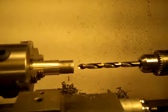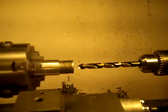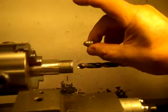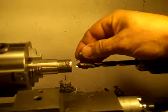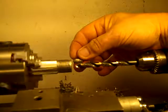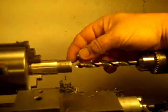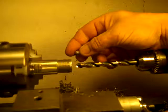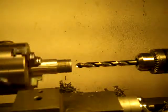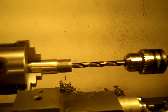I'll show you the object I'm trying to get to. I'm making a swaging die — that's going to be the nose die. It's going to be in a press with a ram that pushes on the bottom. That's going to squeeze it up in there to make it a more perfect bullet, get rid of those grooves, and make it a perfect diameter for making a very good quality 9mm bullet.